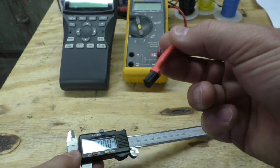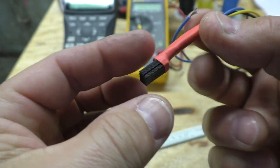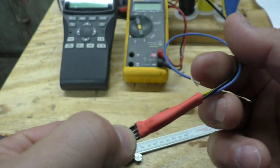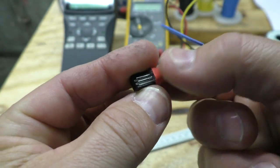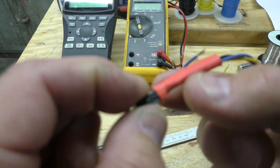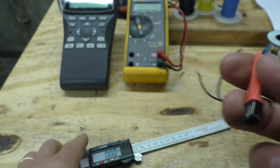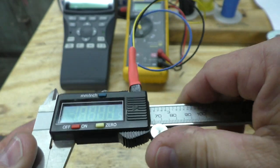I've cleaned this plug up a little bit — I put some heat shrink on each individual pin and then one big piece over the whole assembly. One thing I want to point out: I used hot glue when I made this, and I realized that probably wasn't the best choice. Super glue would be better because when you go to solder on those pins and use the heat gun for the heat shrink, that glue wants to get soft and the pins want to lift up. I had to clamp it while soldering and when using the heat gun. What I've got now is pretty much a reusable plug — the wires won't short out and it goes in and out of the port quite easily.